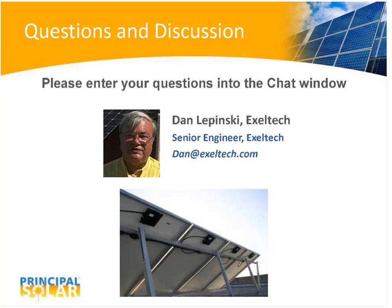Before I start on his list, I wanted to take the liberty as a host to ask a question. Dan, you've talked about a lot of small systems and how the PVAC modules have advantages there, several panels, kilowatt size. I'm wondering, where do you think the boundary is between when a panel-specific inverter makes sense and when to convert to a central inverter? Is that in the hundreds of kilowatts, in the megawatt scale, or what exactly do you look at as the sweet spot for these units?